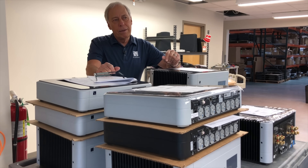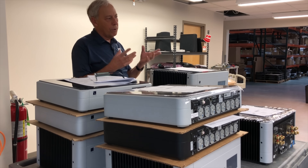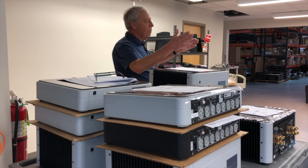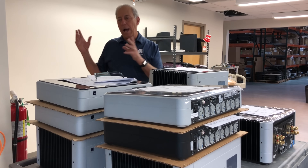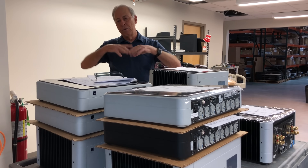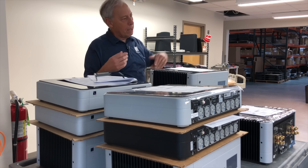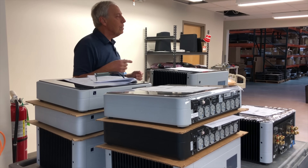When it comes to loudspeakers, we have a whole different situation. What Mark is asking about is DSP with loudspeakers. In order to do DSP on loudspeakers, if you have the output of your analog power amplifier and you're going to feed that into your speaker, and that speaker is DSP'd — digital signal processed — that means I'm going to have to take the output of my power amplifier, convert it to digital, do my magic in DSP, and then reconvert it back to analog after all that's been done.